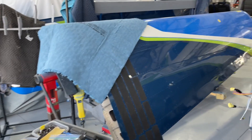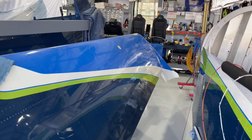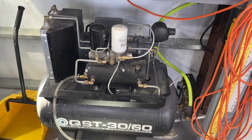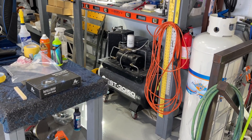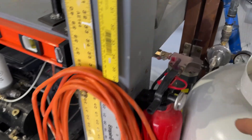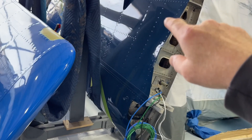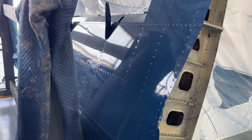I did have several issues. I had some equipment issues — well, pressure in my main compressor. I have this Eastwood 3060 compressor and I think I was holding at about 140 PSI, which was too much. I've dialed it down to about 90 PSI and that's really helped a lot, because that extra pressure puts water in the lines even though I have two inline air dryers. There were several times where I painted the dark blue on this wing and I had blobs coming out in the form of water.